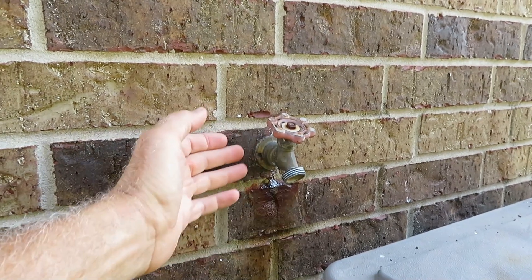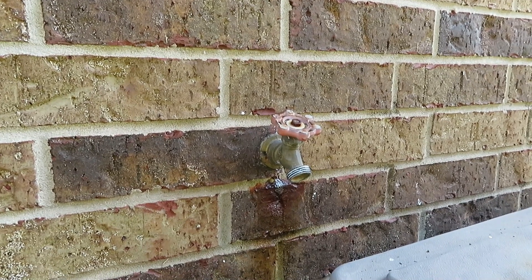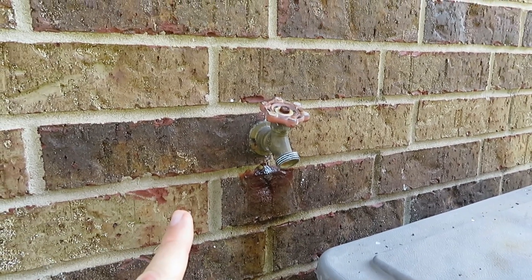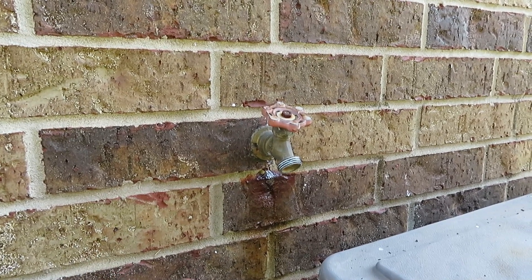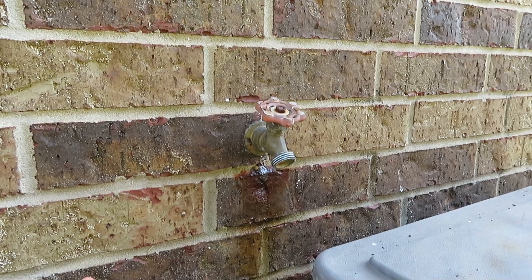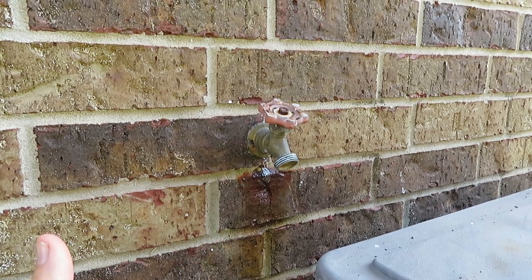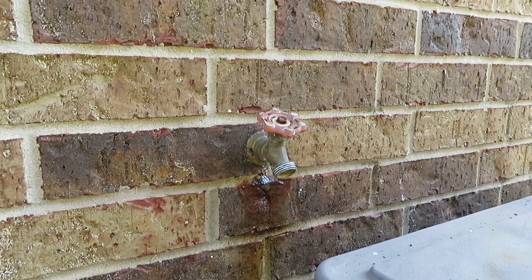If it's leaking here, it's most likely dripping and has gotten the wall closest to the brick on the other side wet also, and that's not good news. So we're going to have to go inside, behind the drywall, and cut out a section of the drywall. I have to check out how much is wet back there. I can always repair the drywall — it's not a big deal — but I need to find out what's going on back there. If it is wet, I've got to leave that hole open to air everything out and make sure everything is dry.